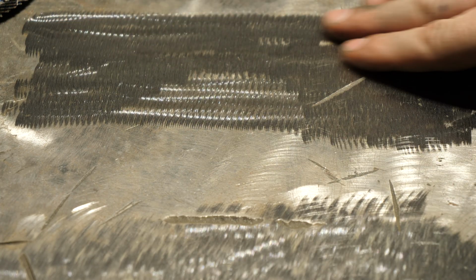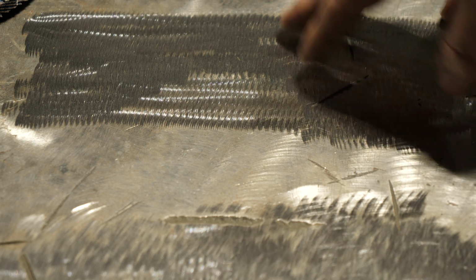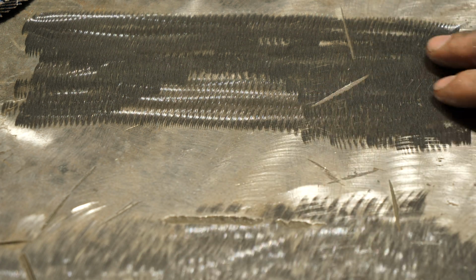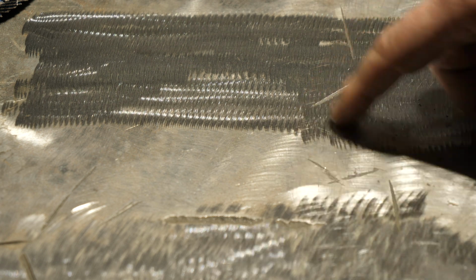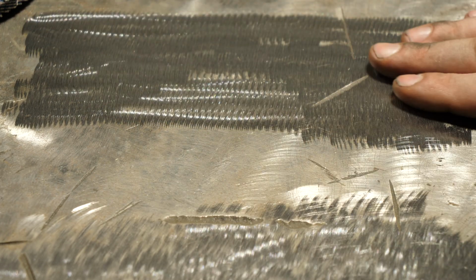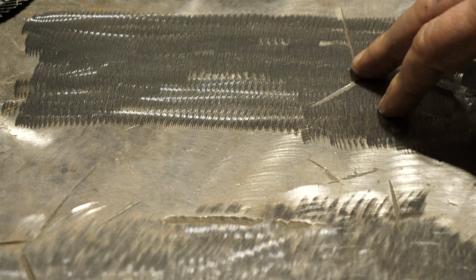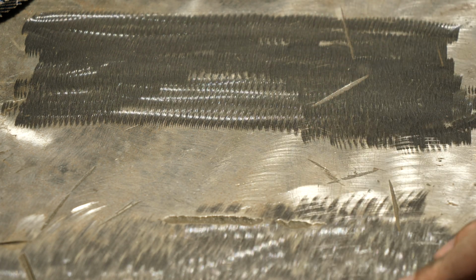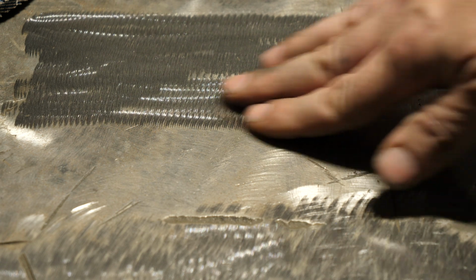So here I have the dual disc that's kind of similar to a cutoff wheel, and let's buff this up. Well, you can see, I would say it almost cleaned up better than the hard rock. It doesn't scoop as much material out. It's smoother. The surface finish is completely different. This still does have peach fuzz on it, so it's not the cleanest, but I like the way that looks far better than the hard rock. It's a little bit easier to get clean straight lines.